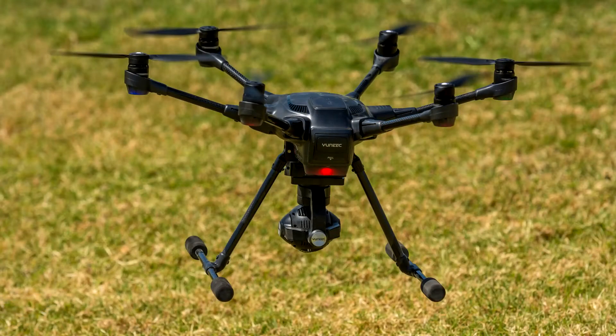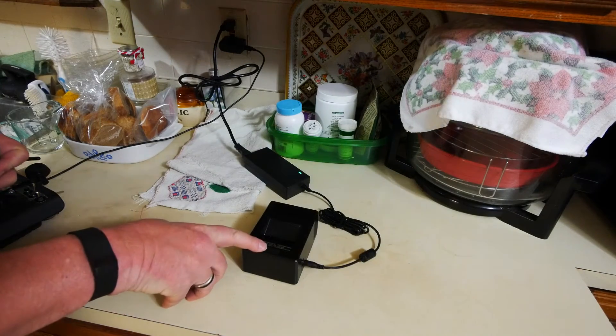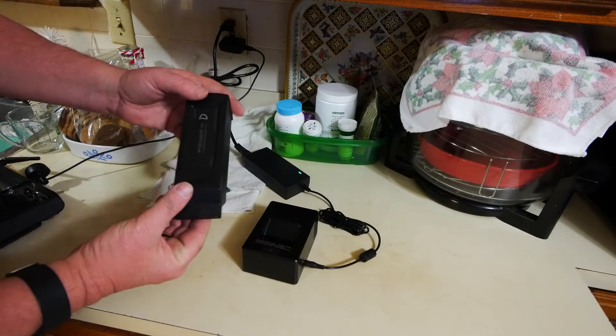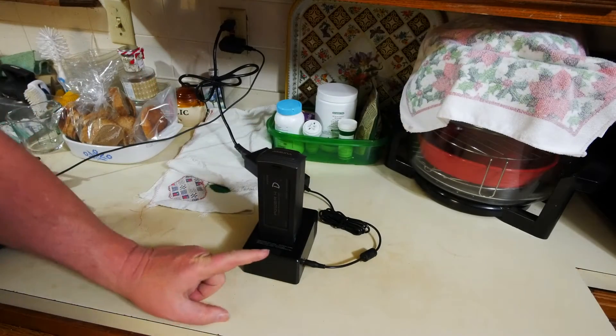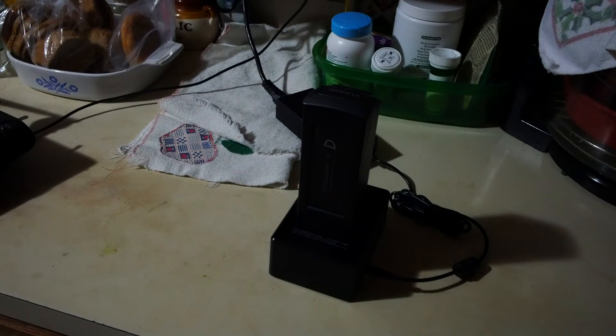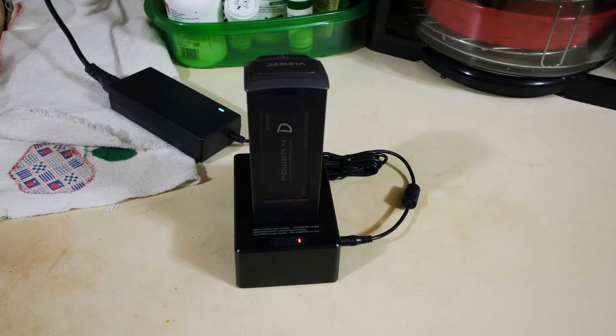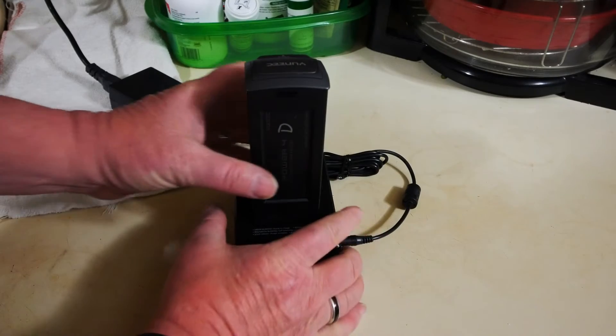Now let's set up some things with the Typhoon H. Before each flight, you need to charge the flight battery. To charge, connect the power supply and the charge base that you received with your aircraft. Plug that into a wall socket and plug in a battery. A battery can take 90 minutes or more to charge fully. Never leave a battery unattended as it is charging, and do not plug the battery in for charging overnight — this is dangerous. LiPo batteries have been known to start fires. Plug your battery in and check it periodically. The base will flicker green and red as it charges, and you'll receive a solid green light when charging is complete. Once you see the green light, unplug the battery from the charger.